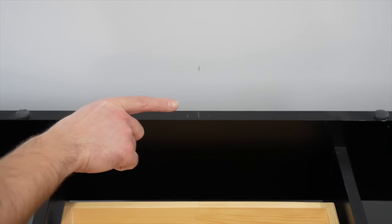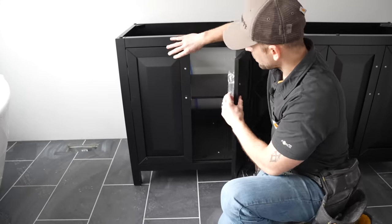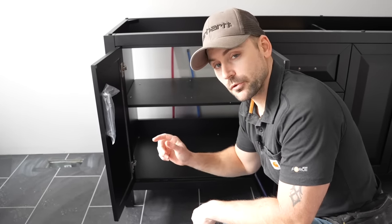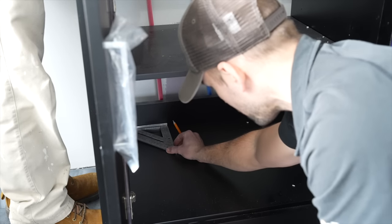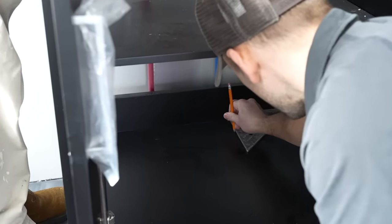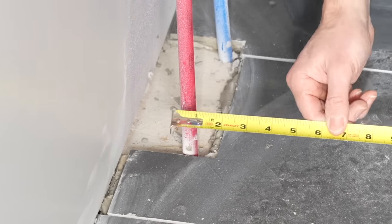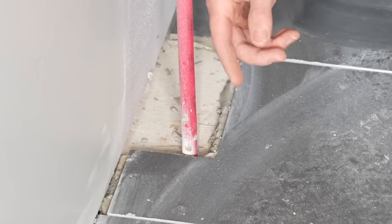As you can see I got to shift the vanity down just a little bit — that looks pretty close. Now that the vanity is sitting up against the water pipes in its install position, I'm going to open up the doors and mark the bottom of the vanity where the water lines will come up through. I'll use a speed square laid against the back of the vanity, mark the center of each water line, and measure two and three-quarter inches off the wall to the center of the pipe.